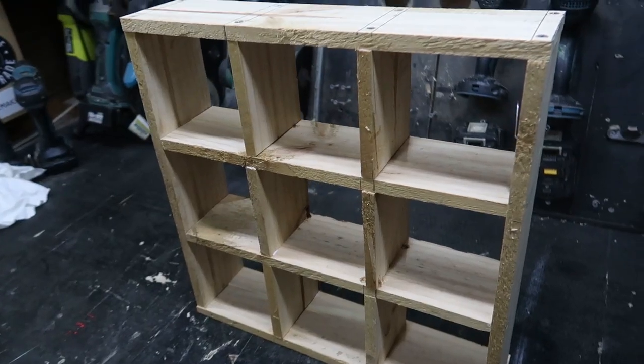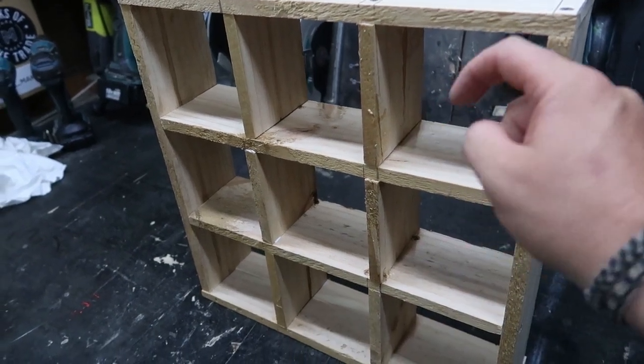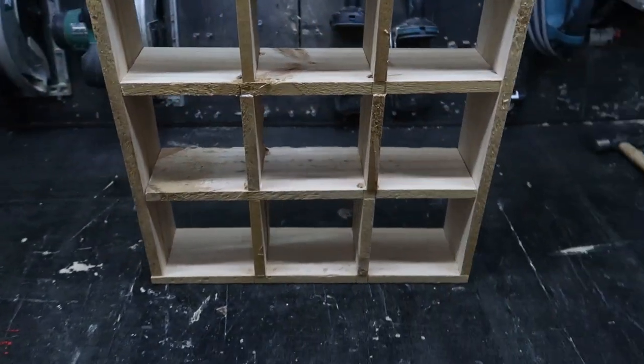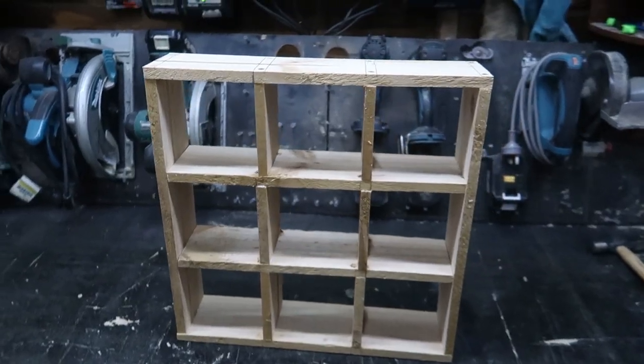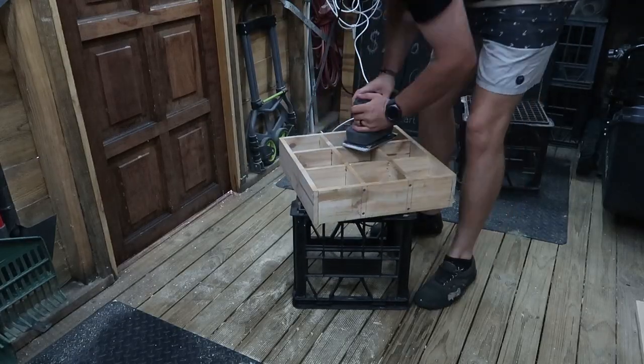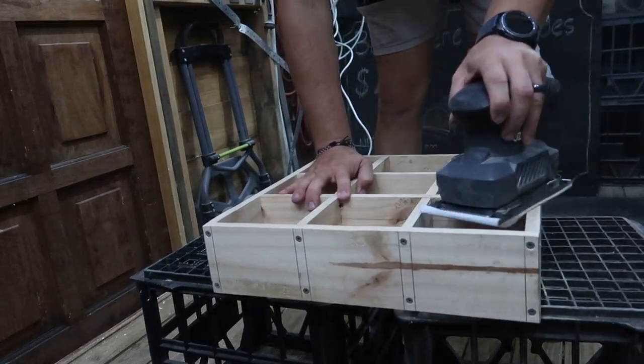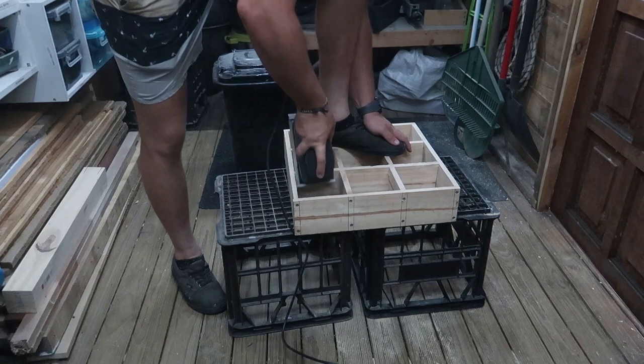That is the center of the frame done — it's come up pretty good I think. The biggest challenge was probably trying to get these center pieces in. I had to put some screws in on an angle; a pin gun would have been a lot better but mine is currently in repairs. So the next thing I'm going to do is sand the whole thing, in particular the face of it. The timber there is quite rough still — I didn't get the planer on that at all. I'm going to work on that and then we'll look at varnish.